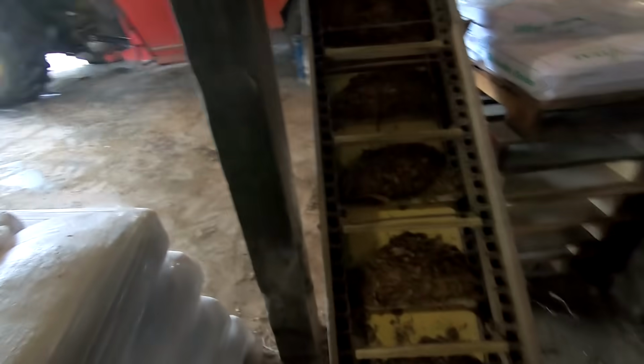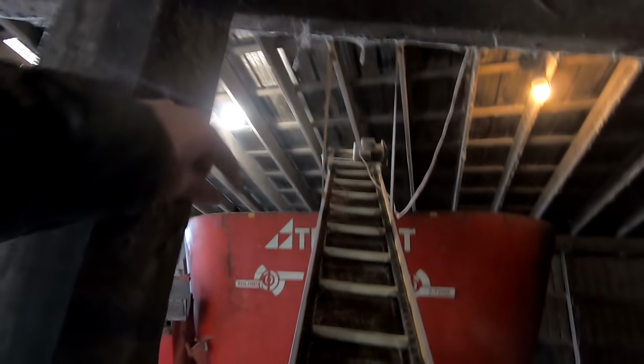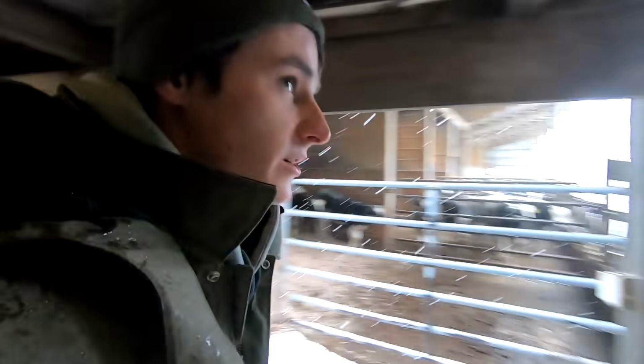So when it gets too long, as the conveyor comes down the hill, it'll kind of fall a little too much and it can start catching right here. And also, if it gets too much slack at the top there where it drives it, it can start slipping or catching things up there. So you wanna make sure you keep it from getting too long.